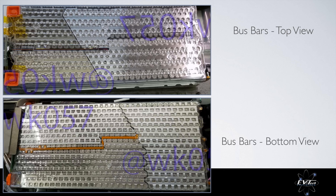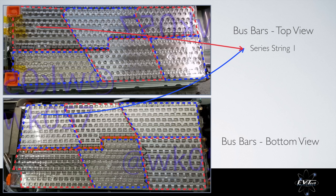Let's take a look at the bus bar. The images show the top and bottom views of the module, illustrating that they appear to be in four segments on the top view and three segments on the bottom view. As this is a module for a 100 kWh pack, each bus bar segment will connect 86 parallel positive cell terminals with 86 parallel negative cell terminals for a series connection between the two, except for those bus bars which connect to the large orange terminals seen in the top image. The red segments show where connections are made with the positive terminal, with corresponding locations in blue on the bottom view as the negative terminals. The adjacent segments have an opposing polarity and the positive and negative sides of each series string are shown.